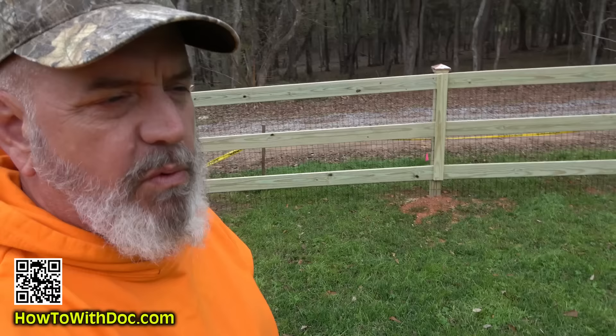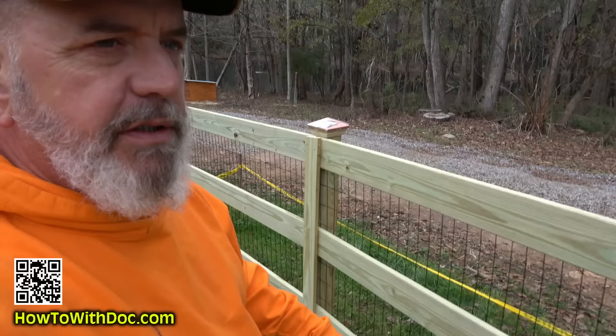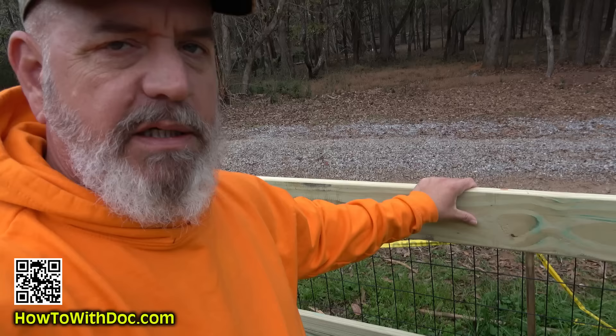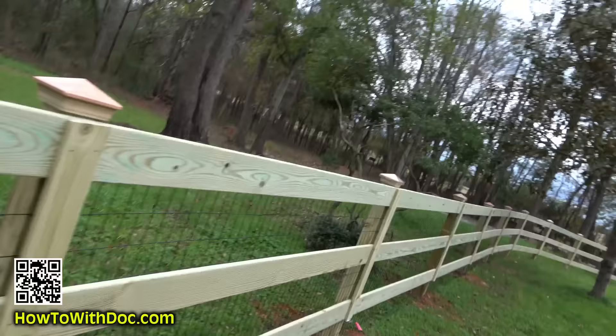For staining I've pretty much gone with Valspar, which is water-based cleanup. Because of the temperatures I'll have to wait until I get a good five days of dry weather before staining. Typically you want your moisture level at about 12% — I'll get my moisture meter and check it. This type of pressure-treated wood is kind of smooth and doesn't suck up a lot of color, so be aware of that. We may have to come back with two light coats — one to seal it and then one right behind it to darken it up.